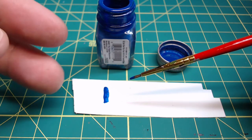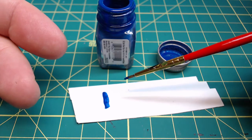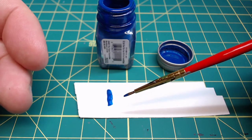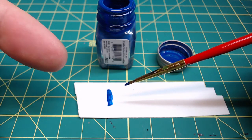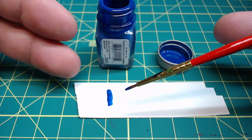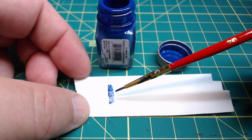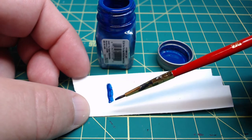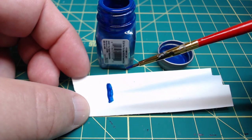This is white and I'm doing a dark color, so some white will show through — I did that on purpose. You can see how the thickness of the paint gives you your color saturation, but if you put it on very thick you'll get texture visible in the reflection of light. It will flatten down somewhat as it dries, but the same rule that goes with spray paint basically goes with brush paint: two thin coats are better than one thick coat.